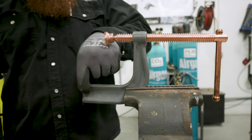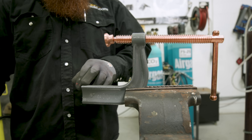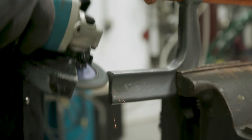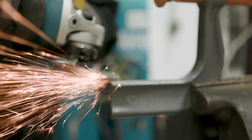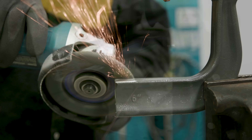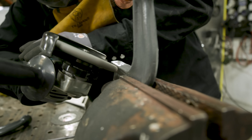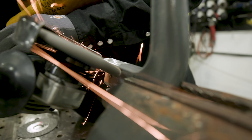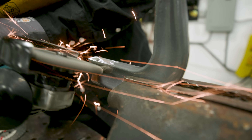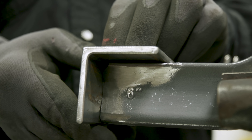Now I'm going to take the paint off the interior area where I'm going to be doing all the welding. Same thing if you guys bought an old one — if you've got rust on there, go ahead and clean all that rust off and take it down to good clean base metal. I went ahead and used one of these polyfan curve wheels because that's going to allow me to get in here and use that contour. You can use a hard rock if you want — this is just one of the tools we like to use around the shop for getting into corners, especially a radius corner because it cleans it up really nicely. Then I went ahead and beveled this so the angle would fit in there a little bit nicer.